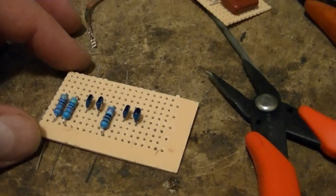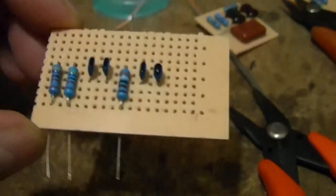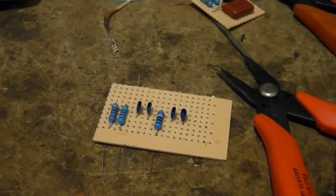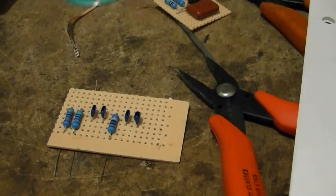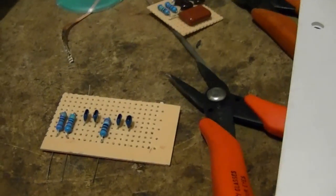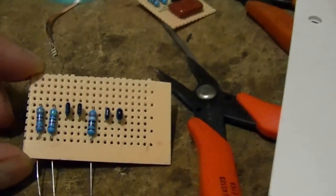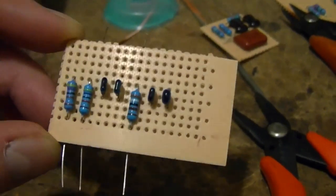Downside to these is they can drift with temperature, although I got the type that are not supposed to drift much, if at all. And there was another odd property they can exhibit, which is the capacitance can vary as the applied voltage across them varies, which can distort waveforms or cause problems. Keep my fingers crossed in this application they won't. Plus, from my autopsy, it looked to me like the originals were probably ceramic anyways.